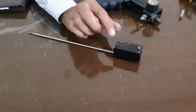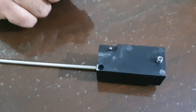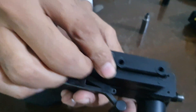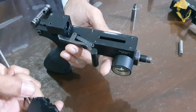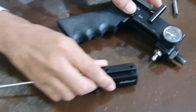When I open this gun, these delrin pads — there are supposed to be three or four of them. There is one missing. What has happened here is that this part goes on here, and every time we move it, when this plastic part came out, this metal starts giving direct contact. You can see the color changes here.